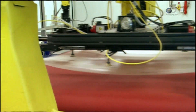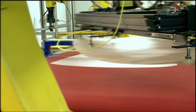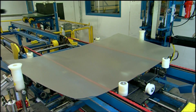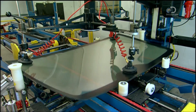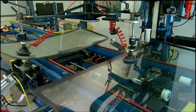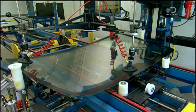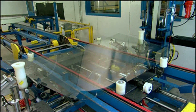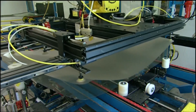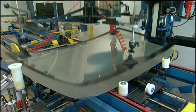A robot picks up a sheet of vinyl cut in the shape of a windscreen. It takes the vinyl sheet to one of the newly shaped pieces of glass, just separated from the other piece. Then another robot lowers the other identical piece of glass onto the vinyl. And that's the formula for glass lamination — two layers of glass with a piece of vinyl between them. In the event of an accident, the windscreen will fracture but not shatter, because the vinyl will hold most of the broken glass together.